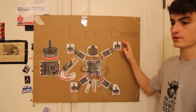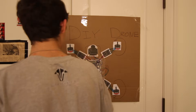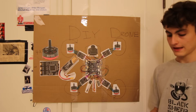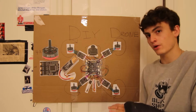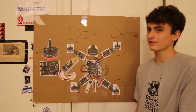The last thing before the video closes: propellers go on each motor. All four propellers spin in different directions — counterclockwise, clockwise, counterclockwise, clockwise. The reason they do that is because if all of them were to spin clockwise, the drone itself would spin clockwise due to motor torque. So they cancel each other out. And those are all the basics to building a drone.